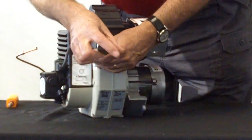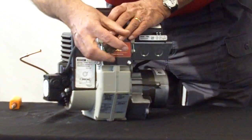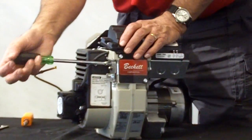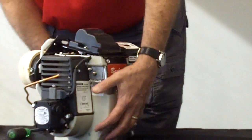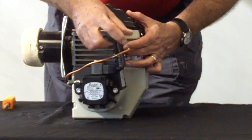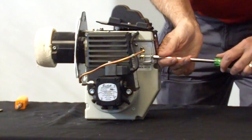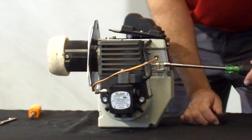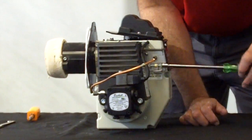Take the adjustment mechanism and turn it until it goes to zero, which is all the way to the front. Then loosen up the acorn nut on the top — this is the only time you work with this acorn nut. Push your drawer assembly all the way forward until the head hits the stops in the end of the retention ring. Now tighten up that acorn nut. With your spline nut on, back the adjustment back to wherever the adjustment was supposed to be per the book. In this case it should be about a three, so I'll set it to three.